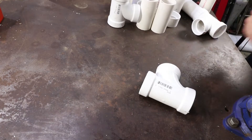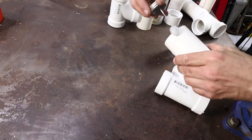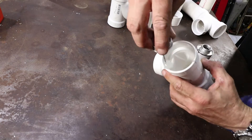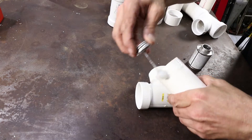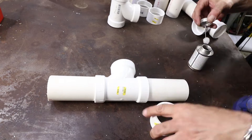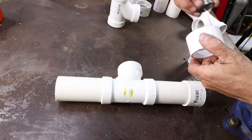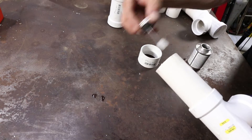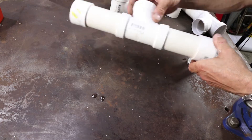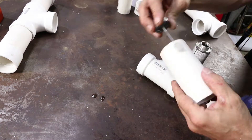Let's lay our pieces out, get our cement, and apply it to both surfaces. We are going to build 2 ends that are going to be identical. Take 2 of your 5 inch pieces and plug them into the long ends of the tee, then apply your caps or couplings. I used to make these out of caps but I found that the couplings are more versatile as you will be able to connect more than one stand together.